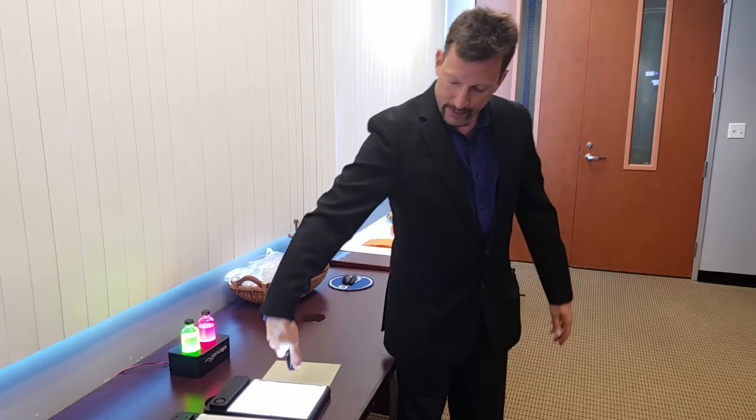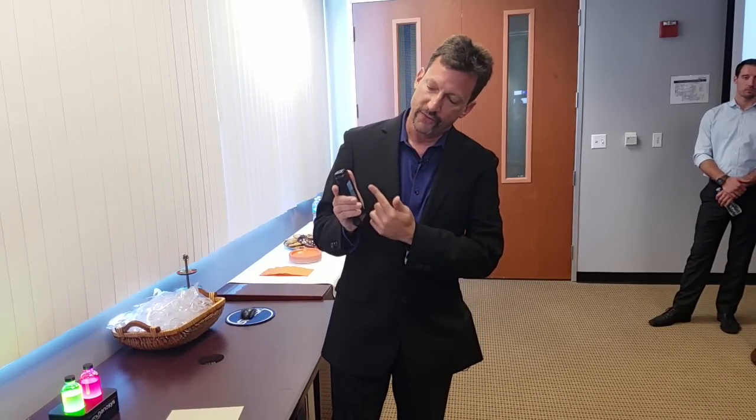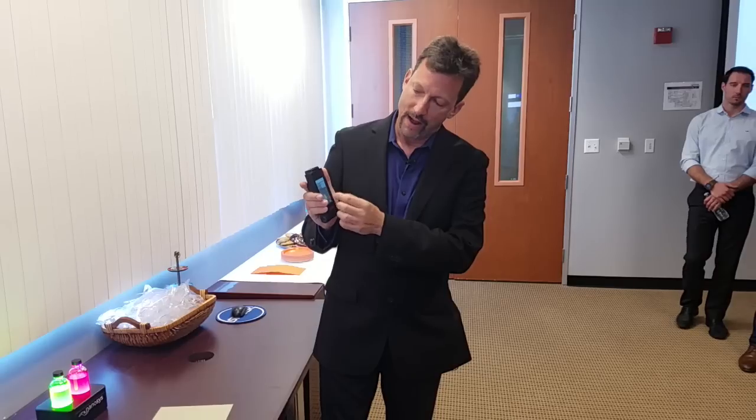What I can do is look at that spectra, and I can see that it has a blue peak, because basically a white LED is a blue LED with a yellow phosphor. The yellow phosphor gives a very nice, long, wide, broad, continuous amount of color, ranging from turquoise all the way out through red.